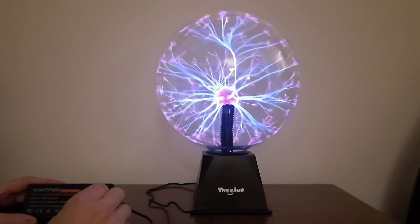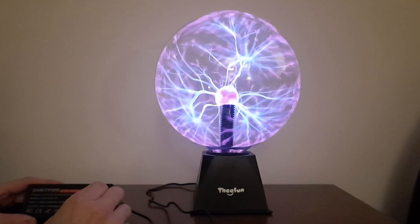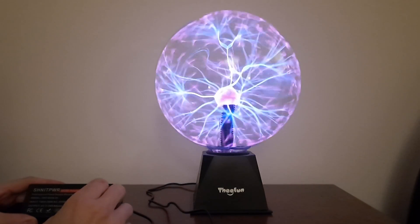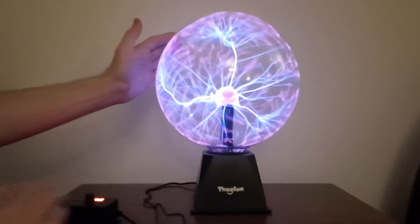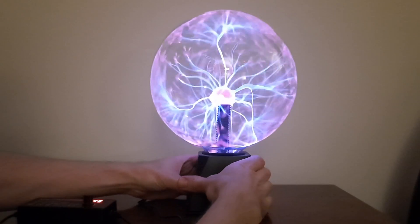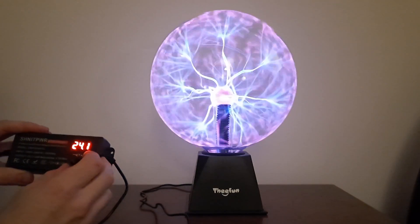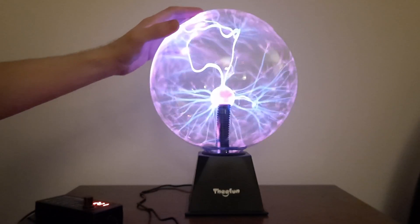Turn it up a little higher. Now, that's more like what I saw when I plugged my laptop charger in for just a moment. I didn't want to run it like that for too long because the laptop charger gives it more than 2 amps. We're still under an amp and a half, so I don't mind running it like this for longer. Wow, that is bright. It's not getting very warm inside there. Let me turn it up slowly to maximum and see what happens. That looks like maximum — 24.2 volts, at no more than an amp and a half.